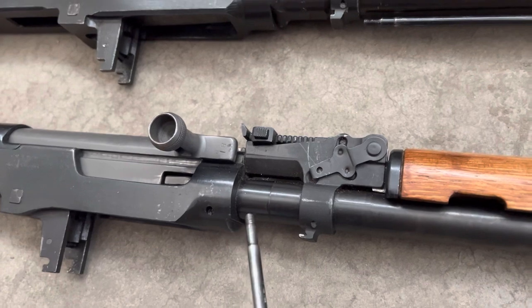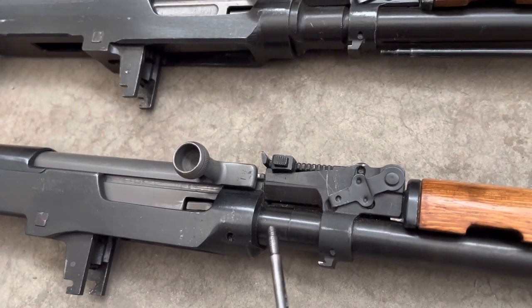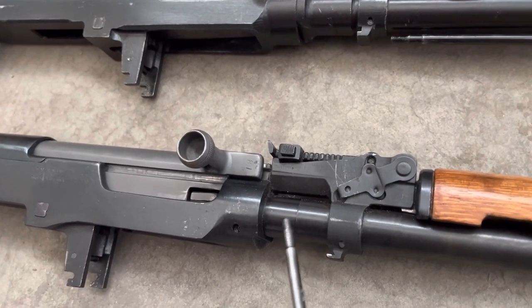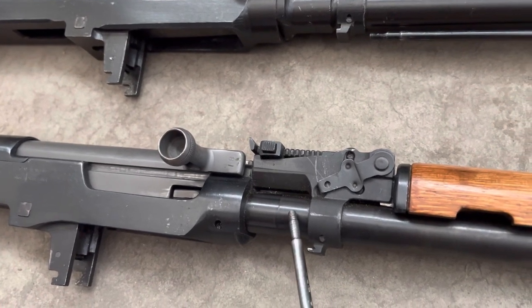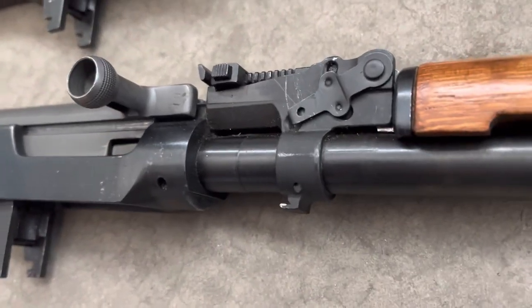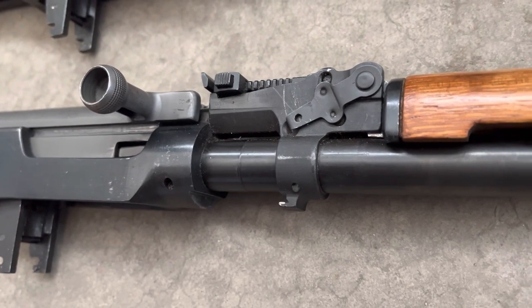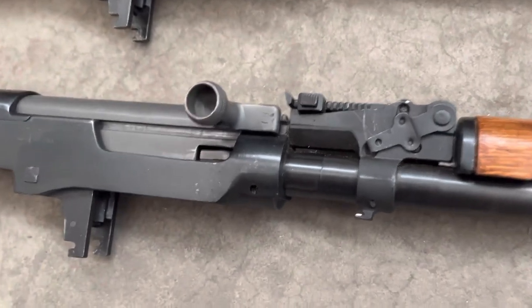When we look down here, we see that there's no lug whatsoever, and there's no threads. So what's going on here? There's a slight shoulder, and that's not a separate component. This is just a slightly wider diameter portion of the original barrel blank, which is heated up, it remains circular, and it's pressed right into the receiver there. Pressing it into the receiver is a lot cheaper and easier, and because you don't have to turn it, it makes it much simpler to set the ultimate headspace.